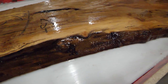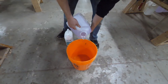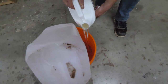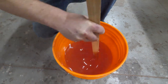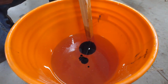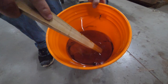We're doing that with the Chemtech Chem 100. And the next day we're gonna come in and be pouring the Chemtech Chem Thick Epoxy, which is here, which is a crystal clear, zero VOC, made in Canada epoxy. It's fantastic, full disclosure. We are a dealer for the product through our Legacy Lumber dealers. I like to hand mix it, but sometimes I also use a drill mixer, depends how I'm feeling. And we're gonna go with about 2 to 3 drops just to give it a smoked epoxy look. I like that translucent, slightly smoked look.